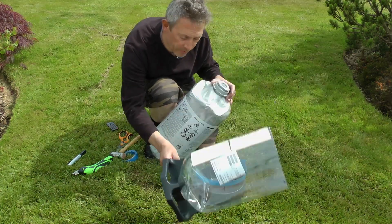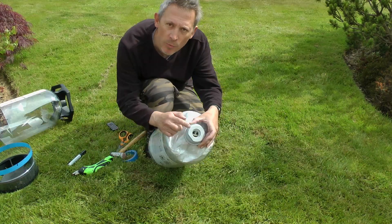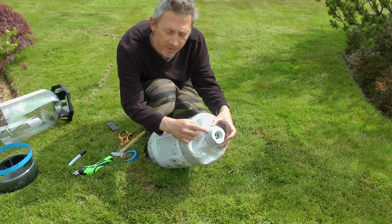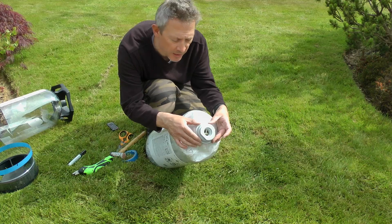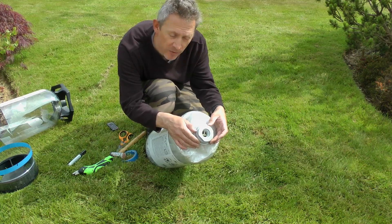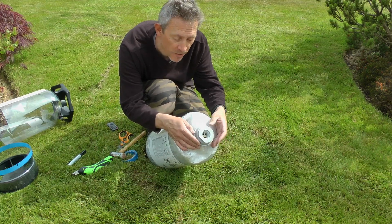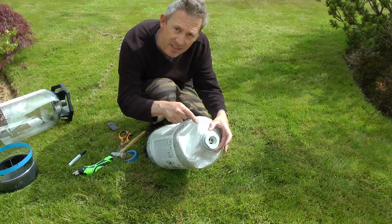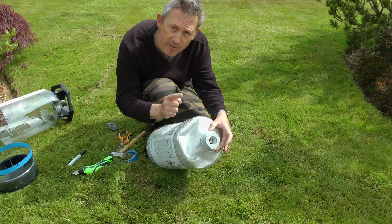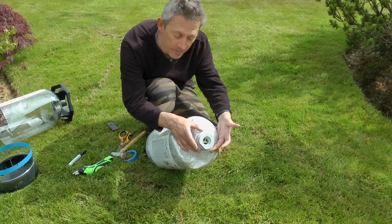The outer section is now off — I don't need those bits anymore so I'll put them to the side. Now what we're going to try and do is very carefully remove this top cap. This is welded on here, so we have to subtly persuade it to come off — it isn't glued. Once you make sufficient cuts you can prise it off. We want to keep this cap because it will then act as the plug for this inner layer to fit in the 30 litre outer layer up at the top, just like it was a 30 litre inner skin. We've just moved inside — I need to use a vice.